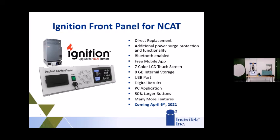I'm sure Rob can answer that, but I'll quickly say no. There are other systems out there that can do thermal mapping of the asphalt pavement. Rob, I don't believe the PaveScan measures pavement temperature directly. Is that correct? That is correct. It does not directly measure pavement temperature, but, and actually, is it Ohio? Craig Lansfeld had noticed that, of course, he combines a lot of technology and puts them together to see if segregation, air voids, density, and temperature have a lot to do with each other. And we all know it does. So once you see low density, temperature can sometimes be a cause of that. But the quick and bottom-line answer is no, it does not directly measure temperature.